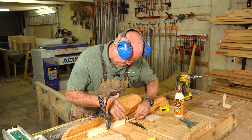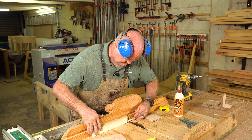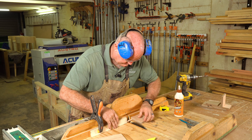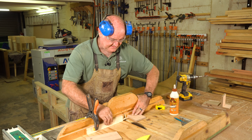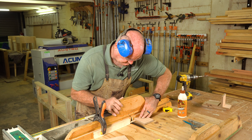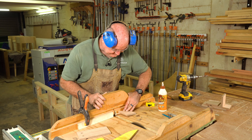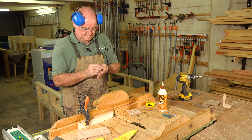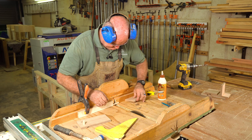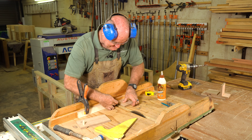Next thing is to decide the length of our dowels and cut those to length. We're going to use the same cross-cut sled. This is fairly small stuff so it's not a good idea to have your fingers close to the saw — use a push stick or something else to hold things down, even a pen or pencil. Don't get your fingers close to the blade; this is where people get injured.